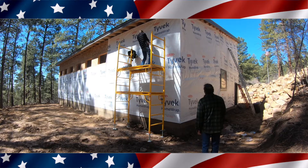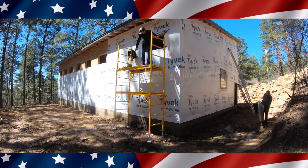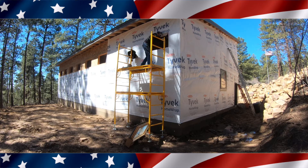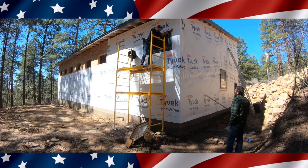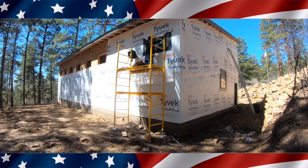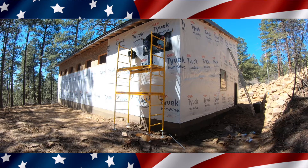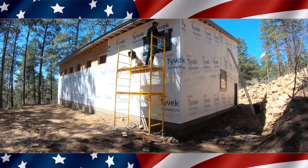I like the look of the back of the house with all the windows in it. We're adding to the scaffolding for the first rear window — these are also Anderson awning windows, two foot by four foot. The back of the house is about 14 feet to the underside of the truss. I haven't decided yet if I'm going to make a flashing for the tops of these windows, since these Anderson windows seem to have their own flashing already. I'll look at that closer before putting siding on. You can see me on the inside shimming it, then screwing it off with jiffy seal under the Tyvek.